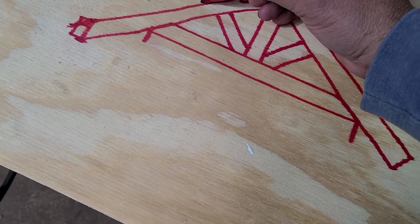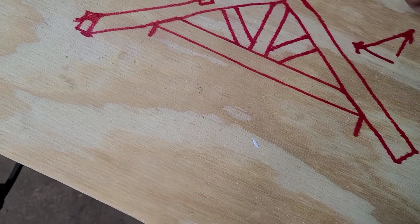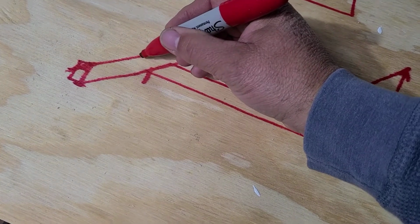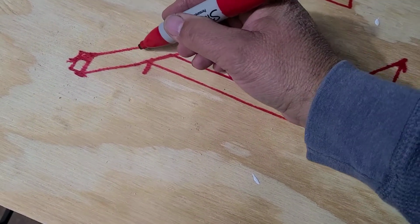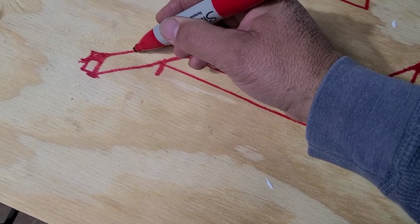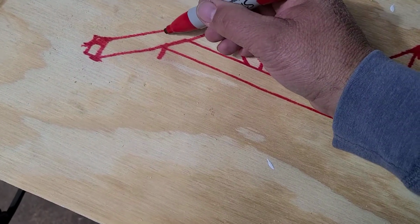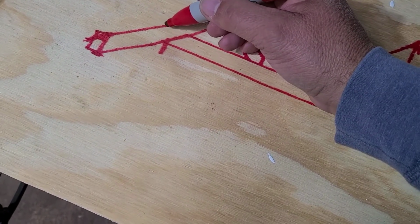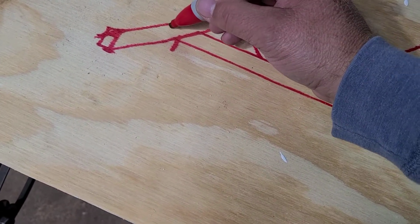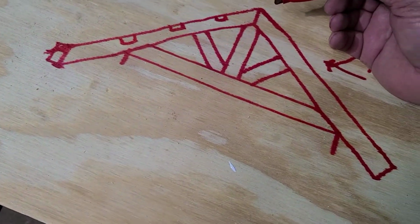So you come down another 2 foot on center, and you put another 1.5 inch deep by 3.5 inch slot, and so on until you get down here. I generally do not go past where the bottom chord, if it were to run all the way out, would be. Generally, I'll stay above your last bird block, and I won't have anything down here. So another 2 foot would put you, say, down here, another 1.5 inch by 3.5 inch slot.